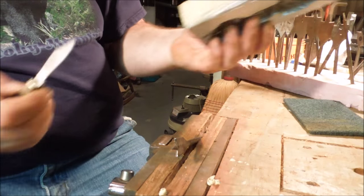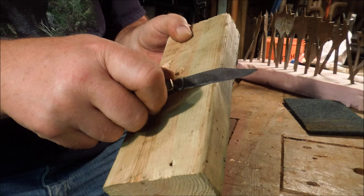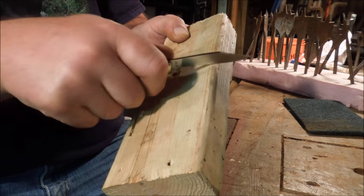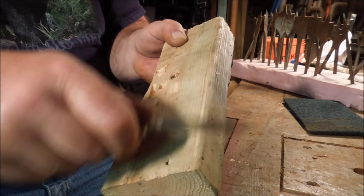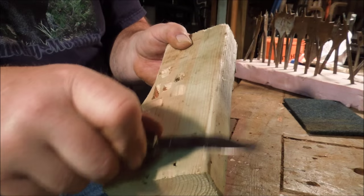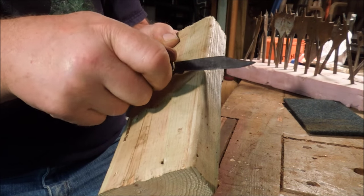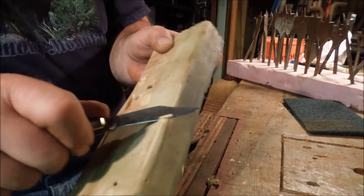When you're cutting with a drill, it's very similar to cutting with a jackknife. You need to have the jackknife at an angle so that it will cut into the wood. If you try to go flat, you end up just scraping — not very efficient. It does cut, but not very well. If you go too flat, it just rides across the wood, hardly doing anything.